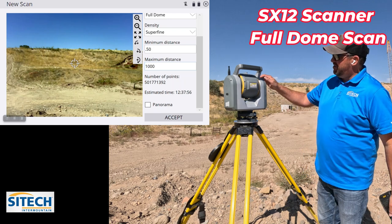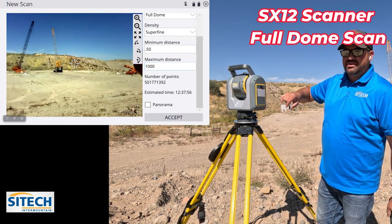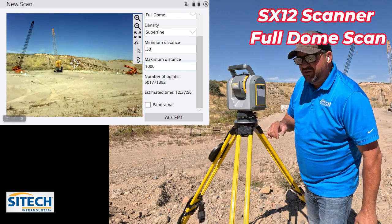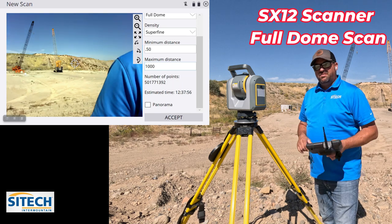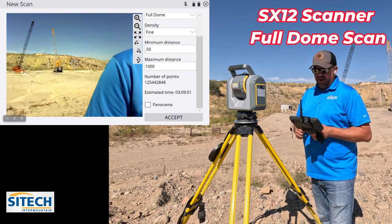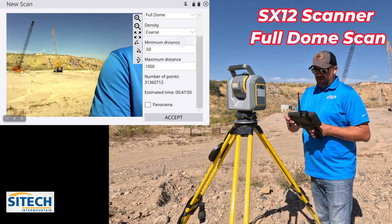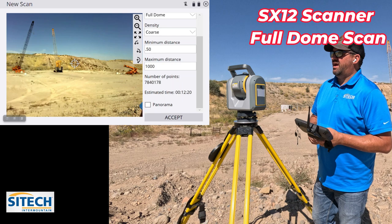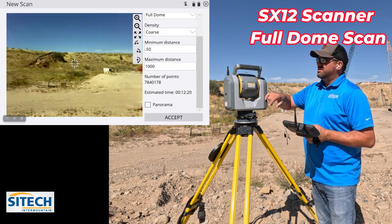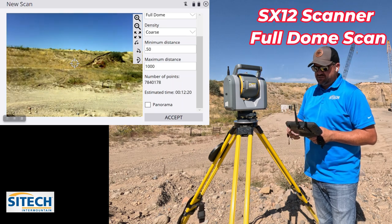Plus, right now, I only have a single battery in the side right here. That battery is not going to last 12 hours. Yes, you can still plug in the external battery pack on the side here, but those are just things to be aware of. And then fine, you can put it on fine, and that's a three-hour one. I'm going to go ahead and put it on coarse because I don't need a crazy, crazy dense cloud out here. The other good thing about scanners that you'll like is that it's going to shoot through the vegetation on that hillside right there.